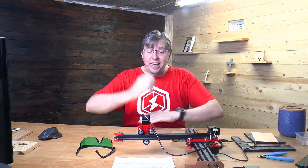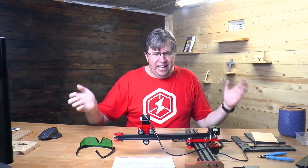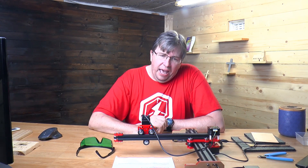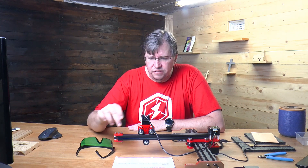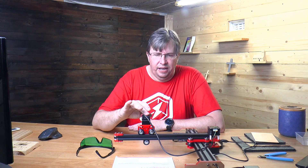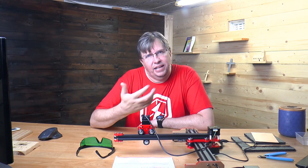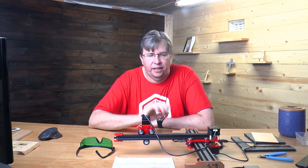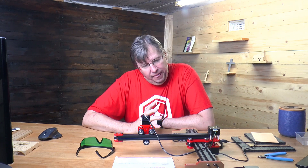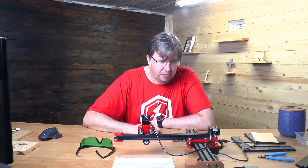I've been playing around with this laser. I was going to show you how to assemble it, but it's literally four screws and four thumbtacks — very easy to build. When I first saw this laser module, I thought because of the long overhang design it would tip easily while lazing. It doesn't — it doesn't move at all. It's incredibly sturdy and stable, surprising how well it holds up because you've got your motors on the other side as counterweights. The design is pretty good, works well, and it's pretty darn fast.